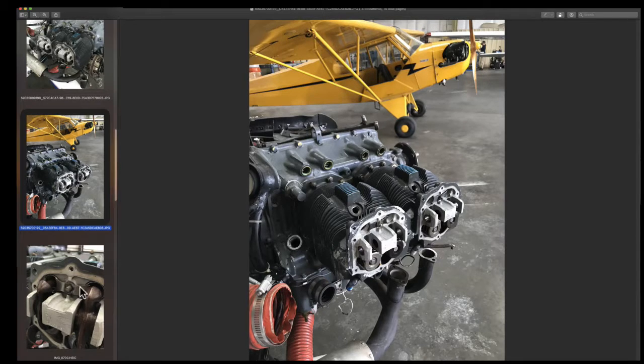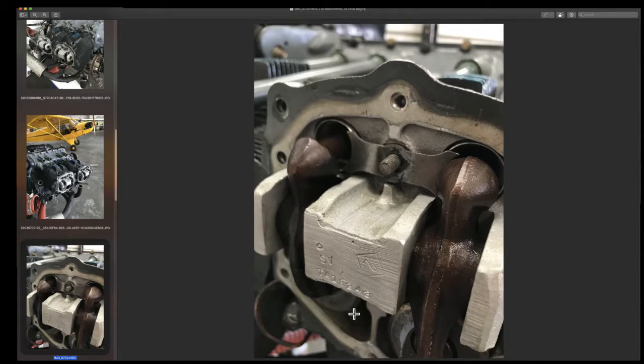So what they do is, I don't know if you can see it, but one of these screw holes where the plate goes on, he built a little, I don't know what you would call it, a piece of strong metal with a hole in it that's bent like an L, and you put a screwdriver in there and you use leverage to push in that spring, and then somebody else is going to take these rocker arms and finagle with it to get it in a little bit, and then push it through, and then when it's good, it's good.